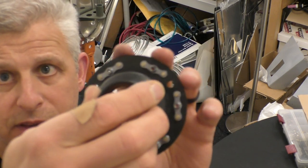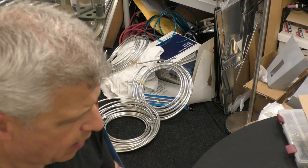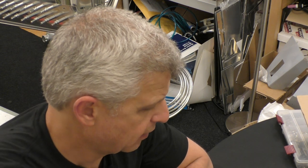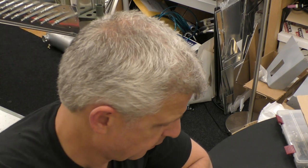All right, that's it. So now all of the nut plates are in place. And now the last step in the process is just going to be getting this trim ring and the underlying skin dimpled and all set so that these number six screws can go in there.